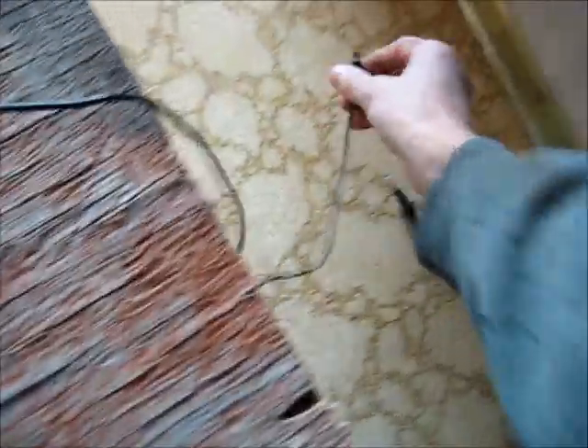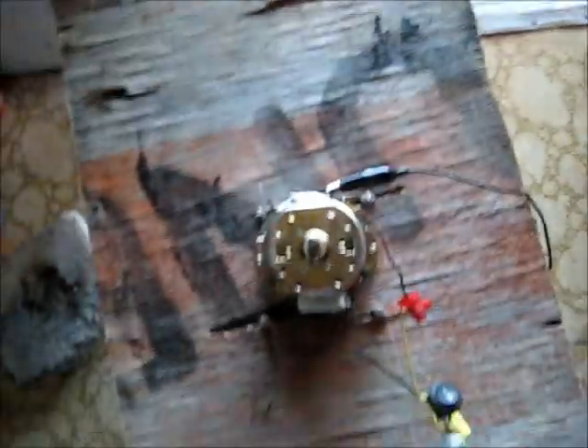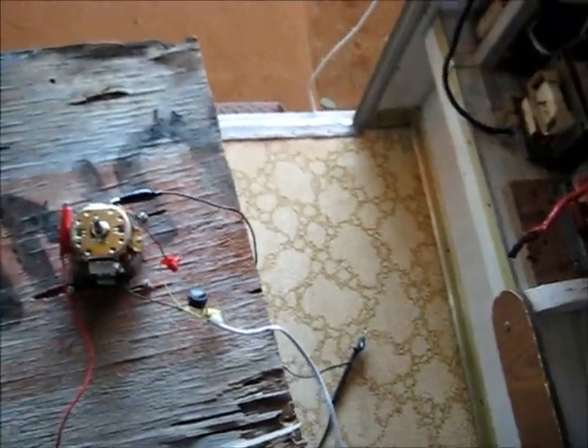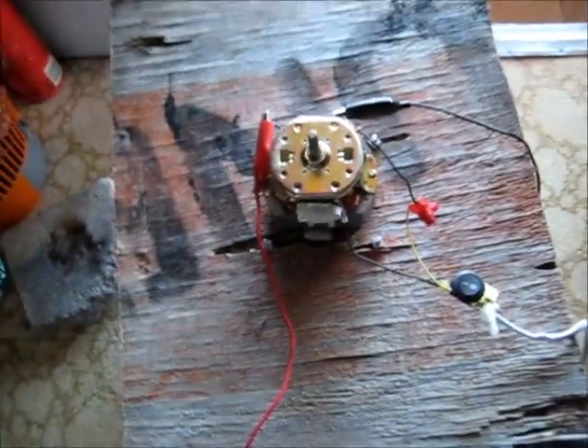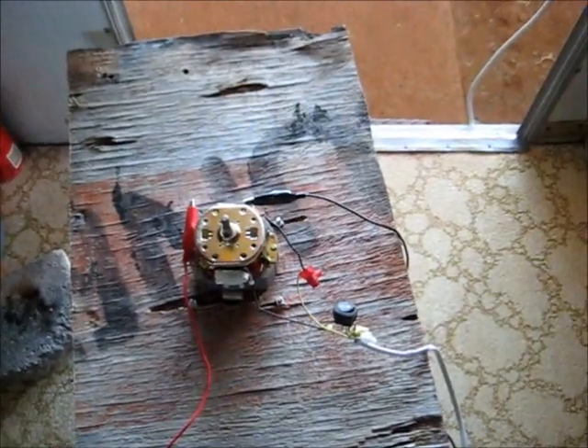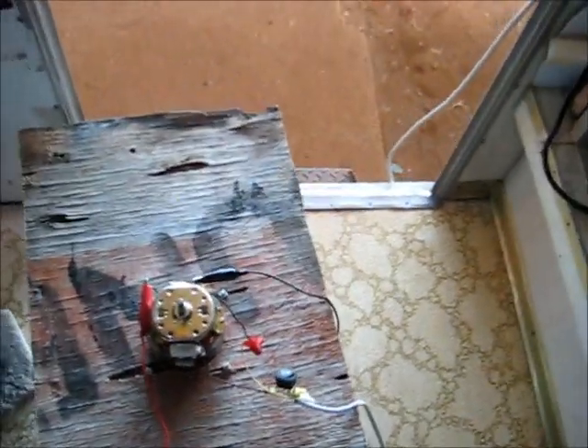Let's do a little multimeter there — just like so. We'll turn it on and see what happens. It's all connected. AC volts, see what happens. 48 volts! A 50s old transformer! Cool! I'm going to plug into that, see what happens. Might pop something. Let's short it out, see what happens. 5 amps — she don't like a shorted field. Now I know what an electric motor of this type behaves like when it's got a shorted field.